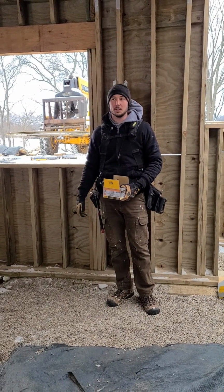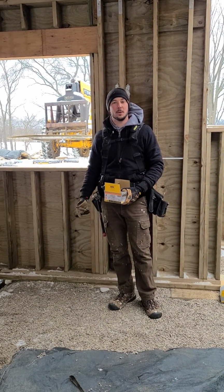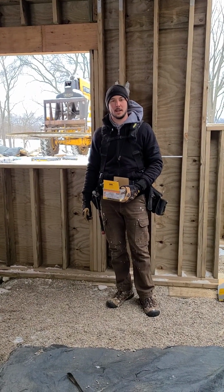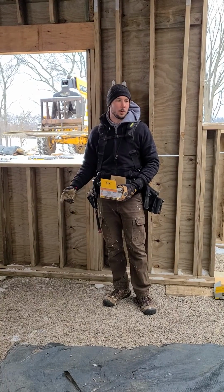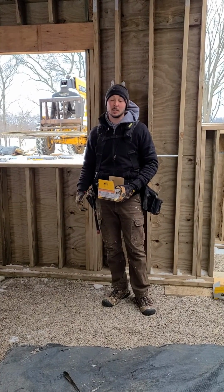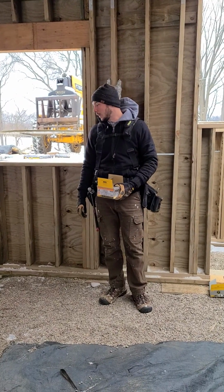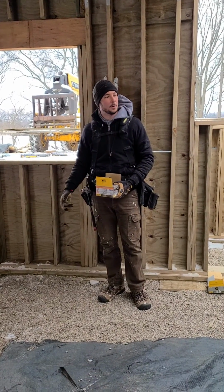So what we'll do is seal this off. We have our ground thawing unit that will run our hoses through here, and if need be, we'll connect our radiator in here too. Warm it up and pour on Friday. Today's Wednesday. It is cold, but it'll be warm enough down here that you'll be able to work in shorts and a t-shirt. It really does heat the place up and will offer a good, even pour.